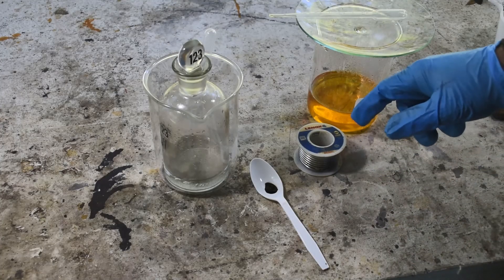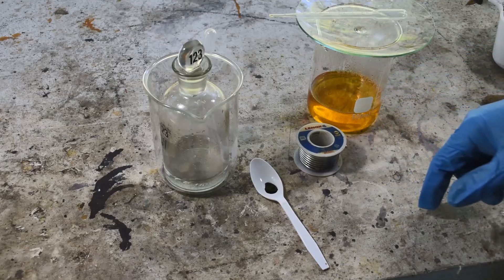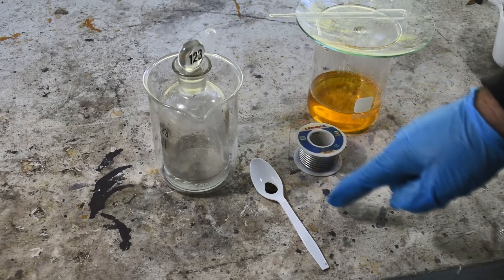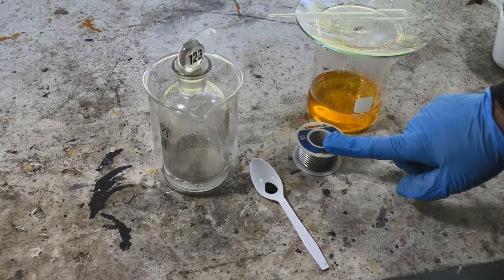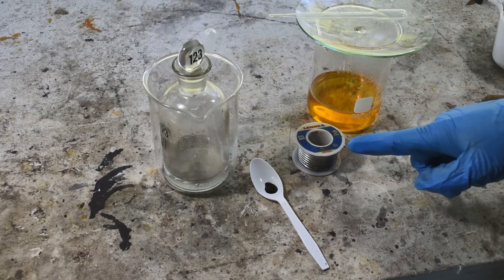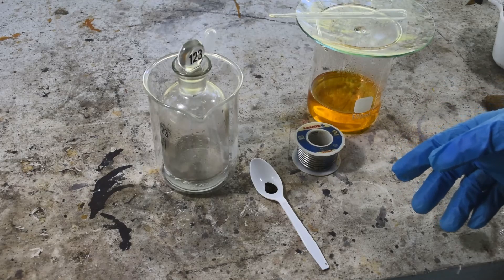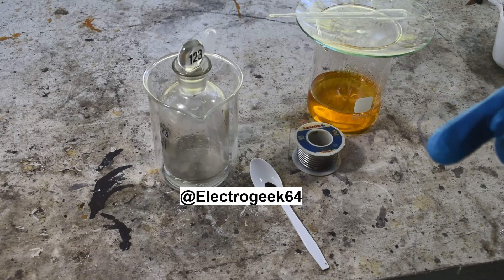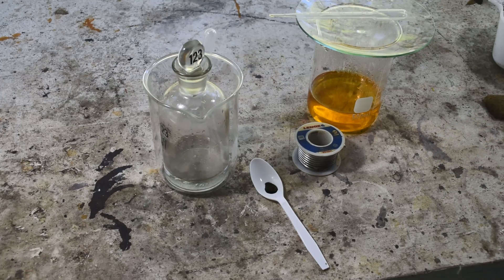I add a little stannous chloride solution — boom, look at that! A really strong signal for gold. I'm cleaning up some gold I dropped out of a dirty solution by re-dissolving it in aqua regia, filtering, and re-precipitating. The stannous chloride solution made this way using solder works great — it's a lot cheaper and easier than other methods I've seen, and doesn't require pure reagents. I hope you found this video interesting and educational. Give it a like, subscribe for more gold and silver recovery videos, and check out my second channel Electrogeek 64 for electronics and retro computing.